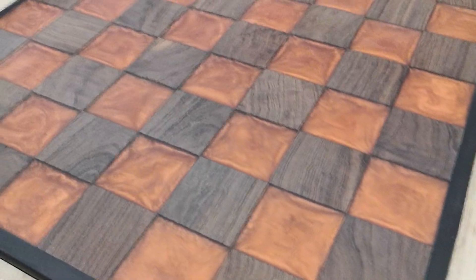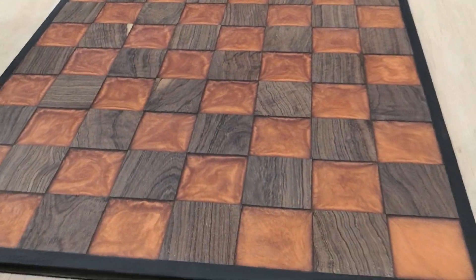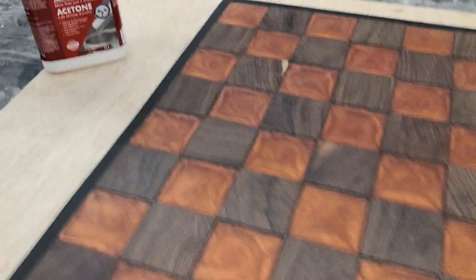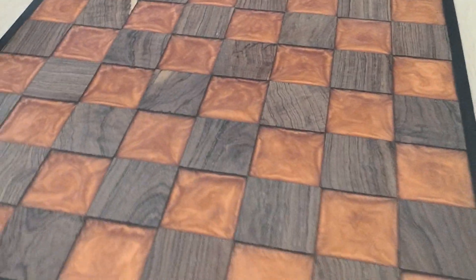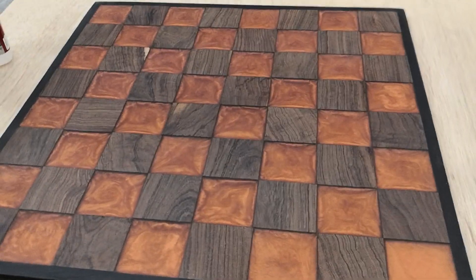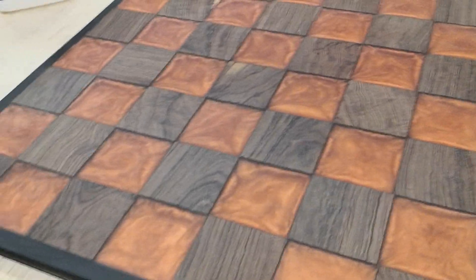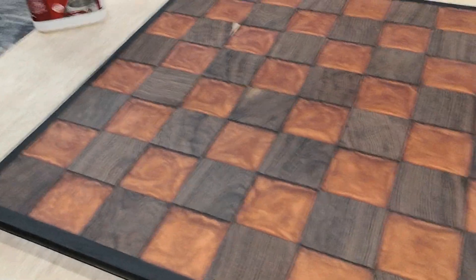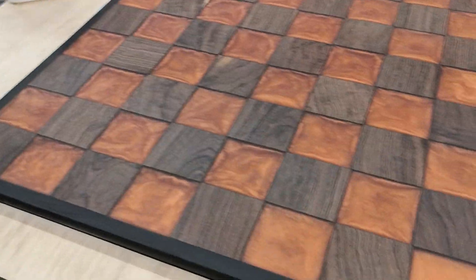It is not yet polished, although it might look like it. The reason for that is without exception I use acetone to clean the wood and epoxy on every project that we do. That removes all the dust particles — I first wipe it with a clean rag and then wipe it off with acetone. It removes every little piece of dust on the wood and epoxy and it almost evaporates immediately.